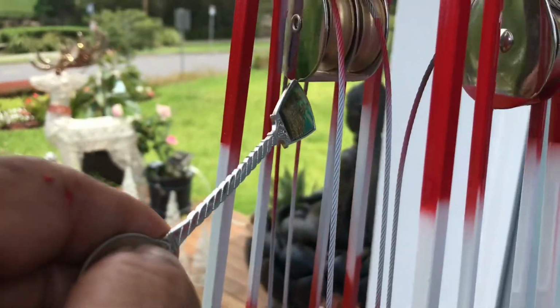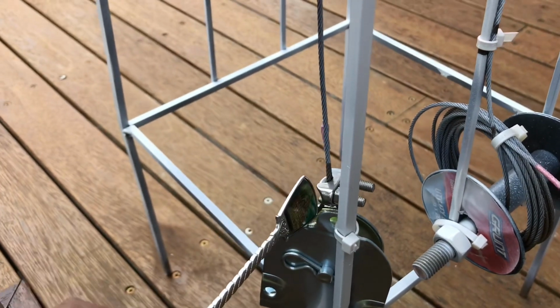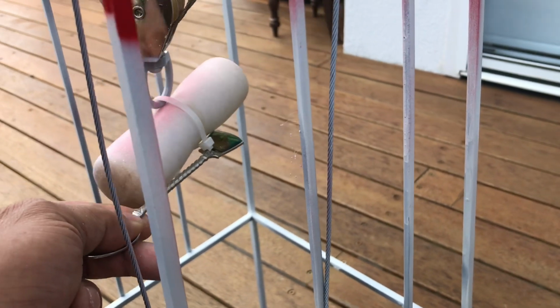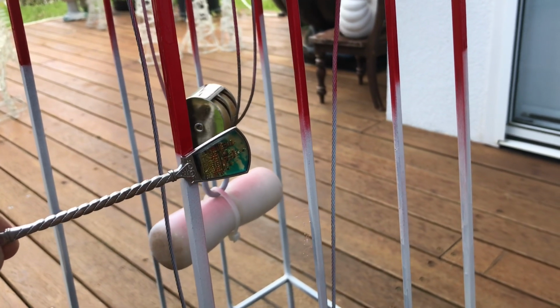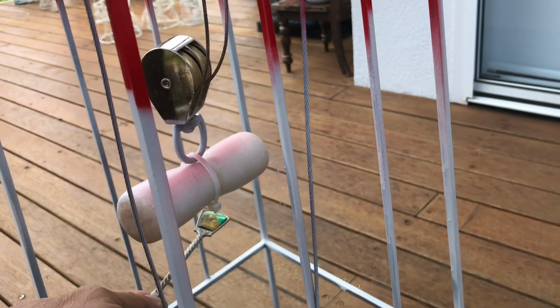From the traveling block it goes all the way up to the crown block. From the crown block again to the traveling block, and the last end from here will reach the deadline anchor. The deadline anchor will determine the weight of the drill string, how much you're going to lift. So your lifting capacity is determined by the strength of your rig, which for a 2000 horsepower is probably 1 million, and for a lesser horsepower it could be 750 or 850, depending on how much you need to lift.